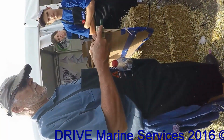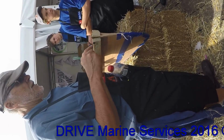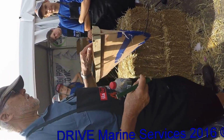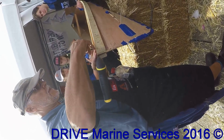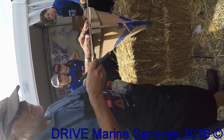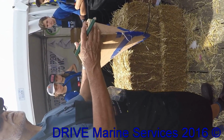Block that off. We're going to put a piece of wood across it like that, a little piece of timber, a nose cut. Now we want it to be at right angle, so we put a little mark here. Happy there? Yeah. Right? And then we just get the saw and put it along there. Draw a line up there. Now we've got to come back enough. Even if we come back here, it won't matter, because we've got to get a flat surface to glue to.